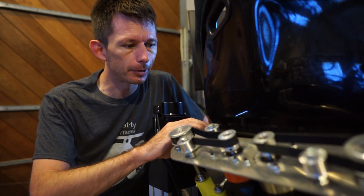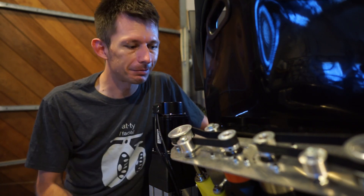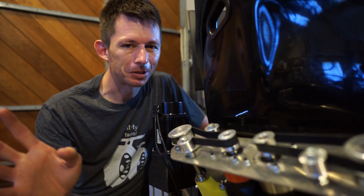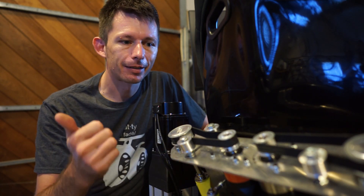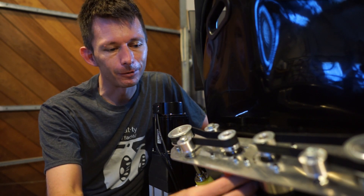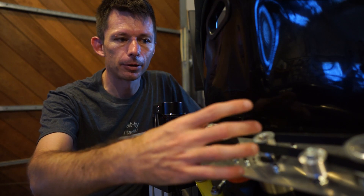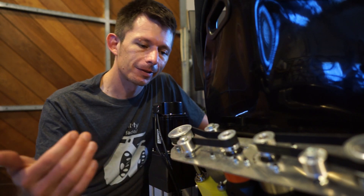It bolts onto the back of the seat — neat little tricks, like using 3D-printed spacers to offset it from the seat and get everything nice, solid, and tight. In here I've got two 60ST servo motors. If I was to do this again, I'd probably go for bigger ones. They're nice and quiet, super fast, and quite torquey — but not torquey enough. So you need gearboxes. I've got some 4-to-1 gearboxes; I'd probably go to a 6-to-1 or 8-to-1 if doing it again. Then into the pulleys, the belt pulley system, out to the shaft, which pushes the push rod, and in turn pushes the seat panel.